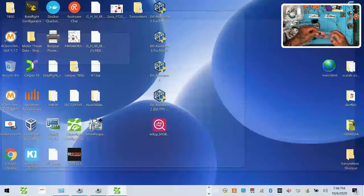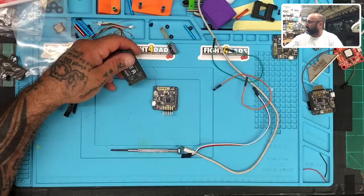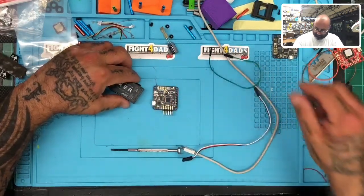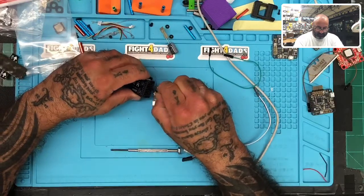Okay. There we go. Here we go. So there's a loose one in there. So what we're looking at is this top rail here, okay? And on here, it's gonna say we have our ground. So it's referring here. So we have ground. Oh no, what happened? Oh, this needs to change. My apologies, guys. Let's do it like this. There we go. Let's go back to the messy desk, okay? Sorry about all that. So we have ground here, positive and S-bus. So we said orange for S-bus, so we'll go right there.